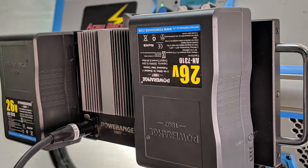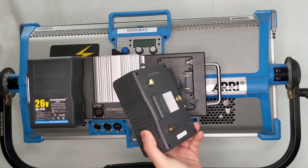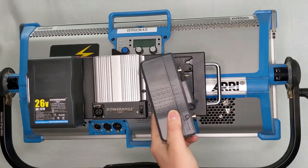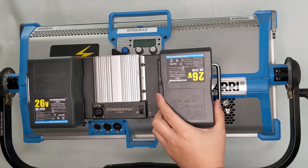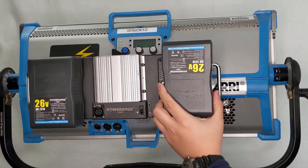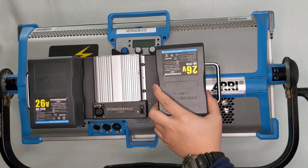Now let's take a closer look at the plate — our system — and talk about runtime and specs. This is the kind of battery it takes: a gold mount 26 volt battery. It's very compact and packs in a lot of power — 265 watt-hours each. They run in parallel on this system so that you're getting 500-something watt-hours total.